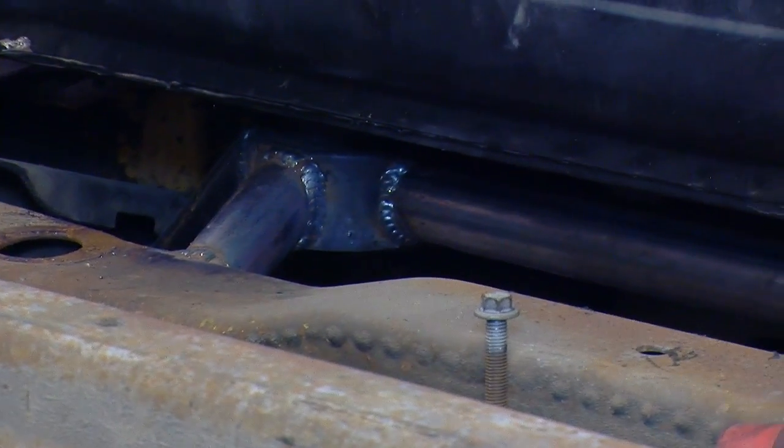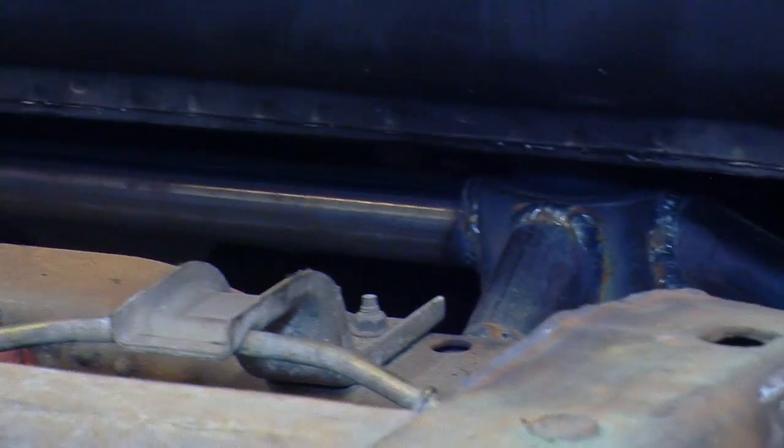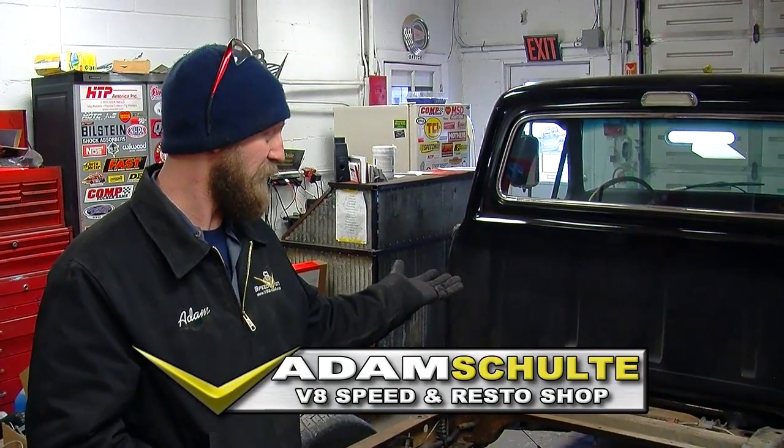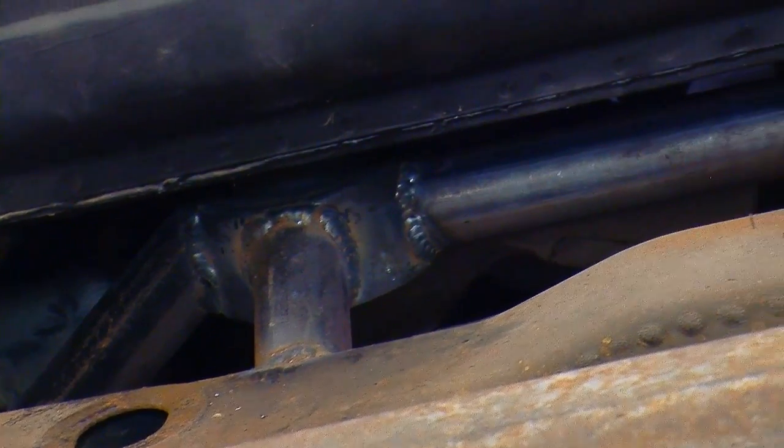We called in our fabrication team to figure out how to connect the dots on those front cab mounts. Since we didn't want to move the middle cross members so we could continue to use the factory tank, I made another cross member that's actually going to hold the rear cab mounts. We made this out of cage tube and some 4-inch pipe.